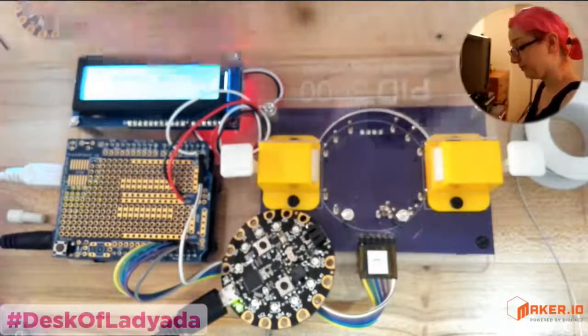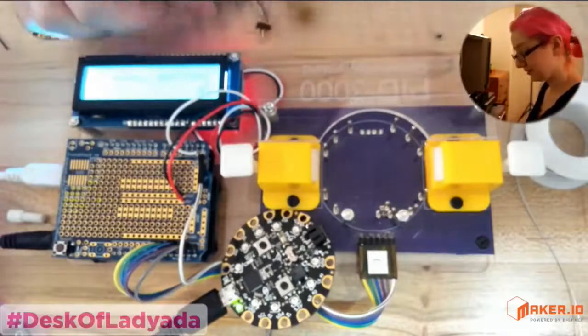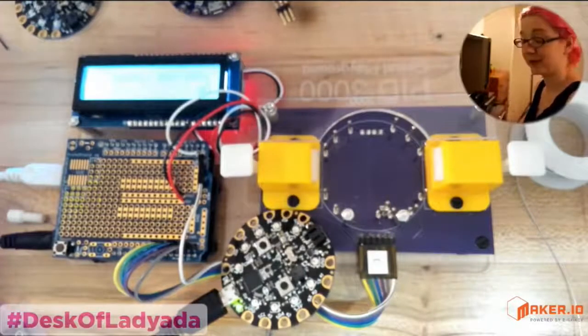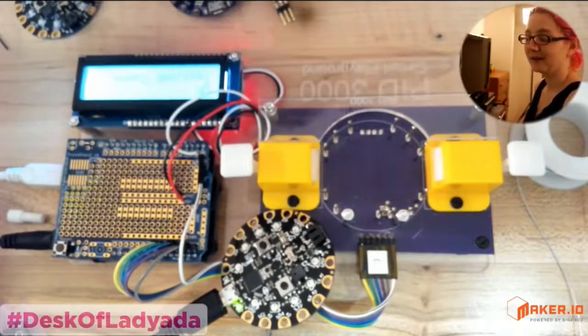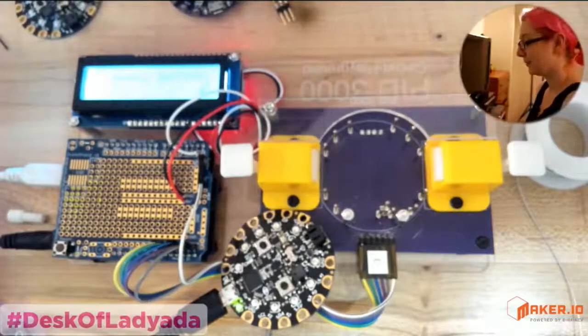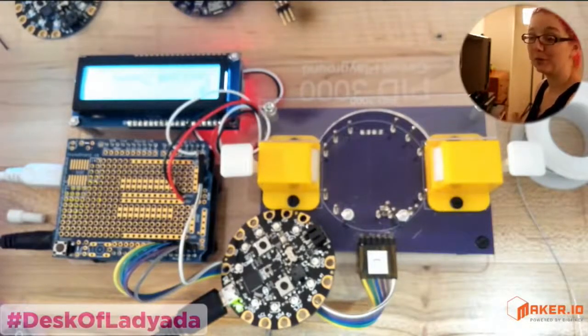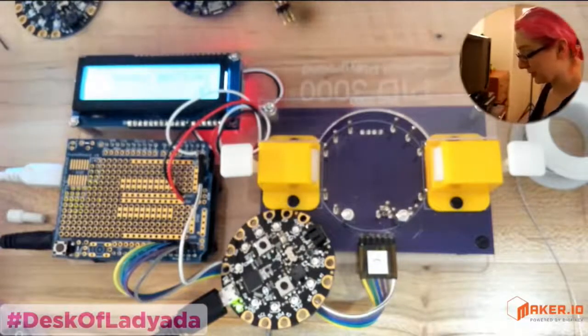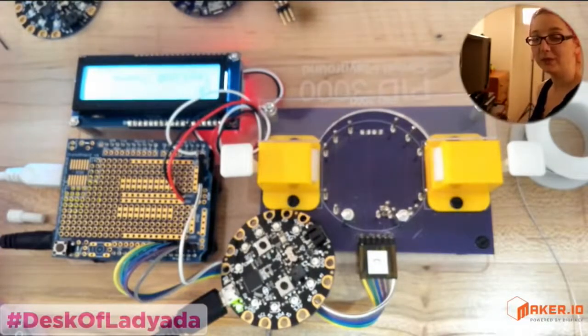You have a tester, you test it, solder in all the components, and hopefully the first time you bring it up, you'll get something going. I know that one of the frustrating things about bring up is sometimes it doesn't work at all, and then you're going to have to figure out what is it that's broken? Sometimes it's the power supply, sometimes your reset circuitry, sometimes you solder a component backwards and it's pulling down a line. So that's a joyous part, and that's why I always build three boards when I do prototypes.